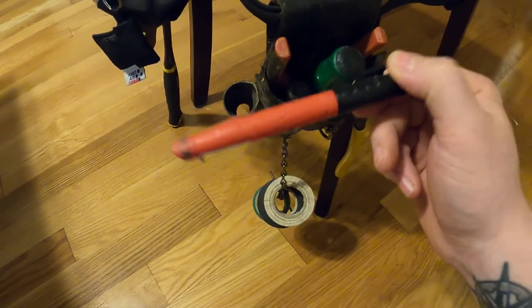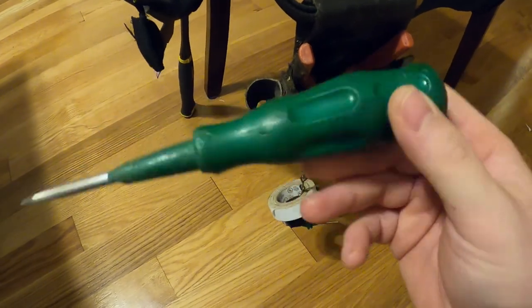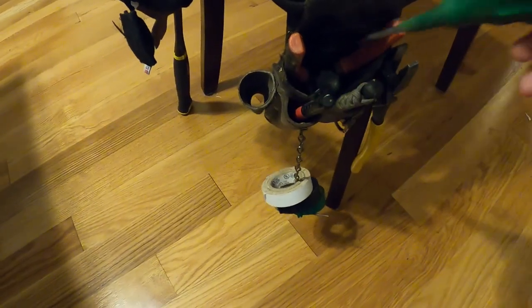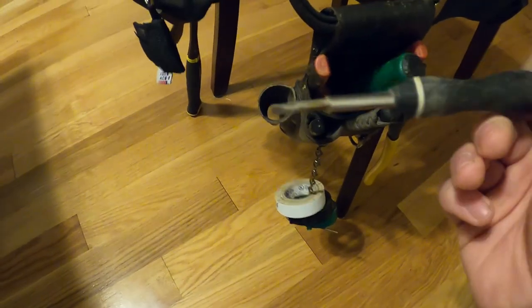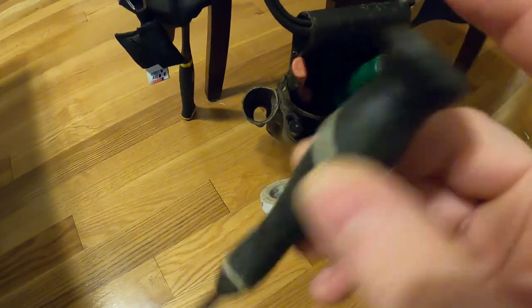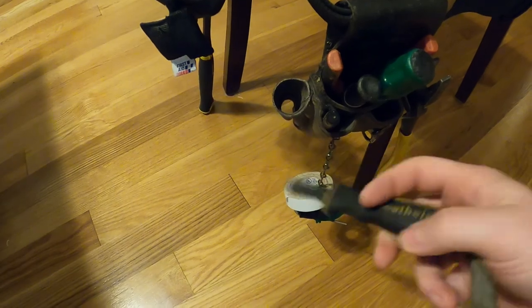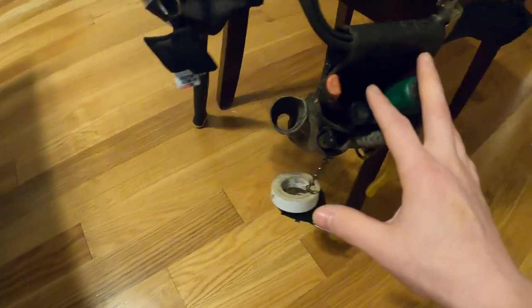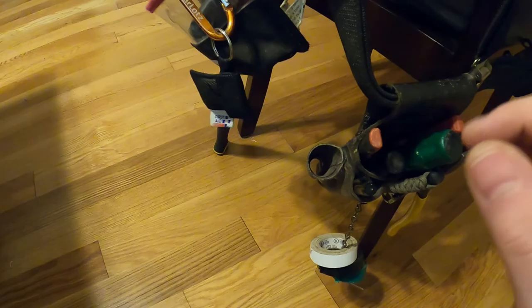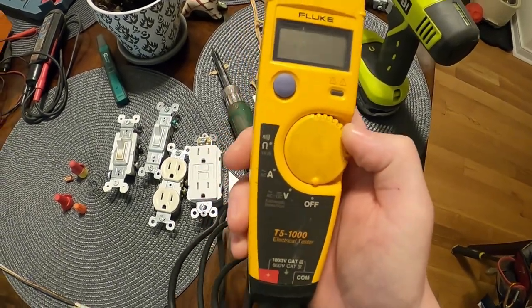You've got to have a Sharpie — another important tool. You will end up needing a beading screwdriver; in residential work you will use and abuse this. It's helpful to have a little fine-work screwdriver with multiple tips as well, just a cheap one. And then some sort of cutting tool — these are cheap and do the job correctly; you can use a pocket knife, whatever you want. But most importantly, whether you're in commercial or residential, you need some sort of meter to make sure things are not hot, because that will save your life.